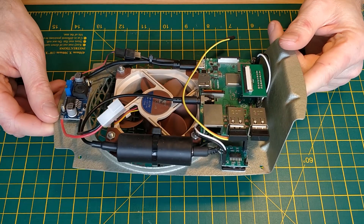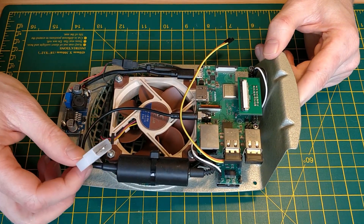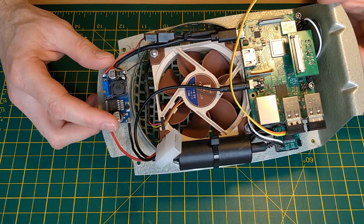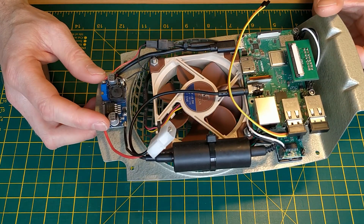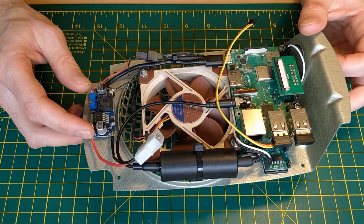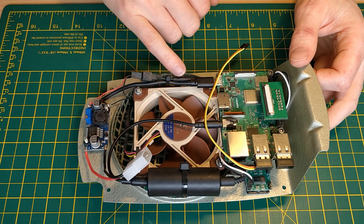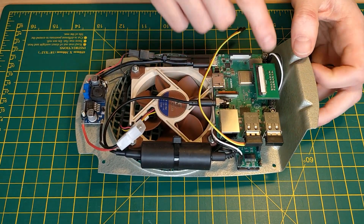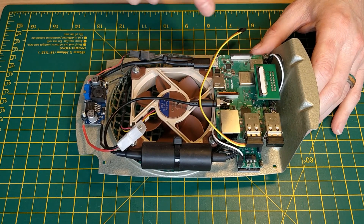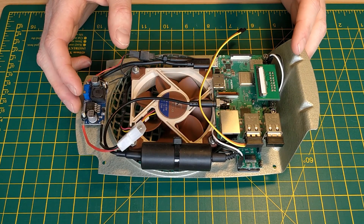The main board is where most of the magic happens. It was definitely a bit of a challenge to fit everything in here. The power from the laptop supply comes in through a Molex connector and is fed straight to a buck converter, which knocks the 19V down to 5V DC. This buck converter should handle three amps. In practice, I've never had any issues with power for the Raspberry Pi. The 5V then heads in two directions: one to an 80mm Noctua 5V fan, and the other through a USB cable to the Pi itself. The Pi is a Model 3B Plus, which is more than adequate for classic console emulation and RetroPie. I've never seen temperatures above 45 degrees Celsius on either the GPU or the CPU while it's in operation.